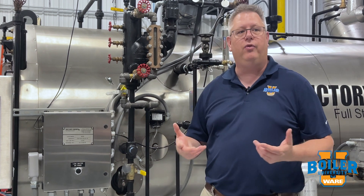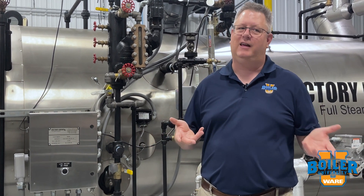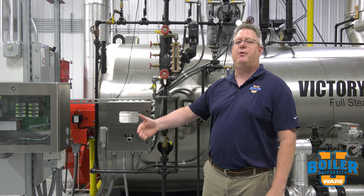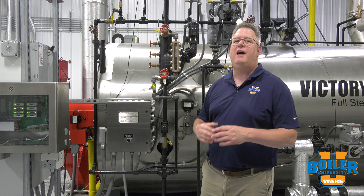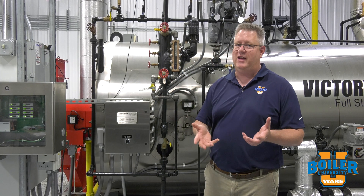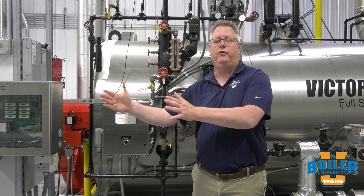The shunt button allows you to hold the bypass for the duration of the blow down — I like to count to 10 just for good measure — to make sure we don't interrupt the operation of the boiler. This functionally clears the float chamber, which is one of our objectives, but it doesn't necessarily test the electrical circuitry.